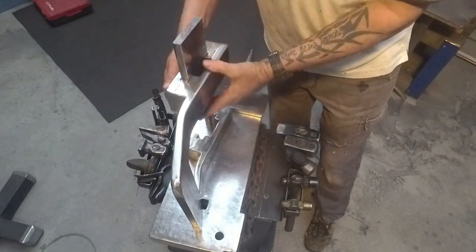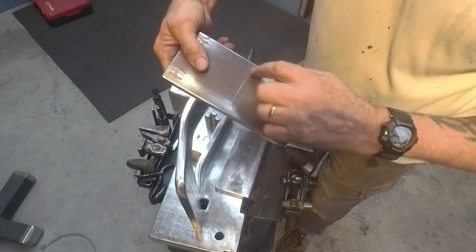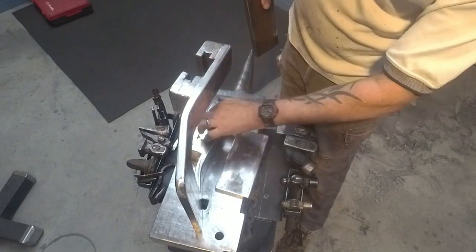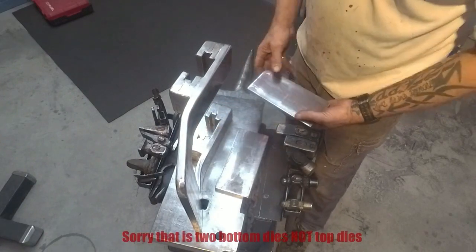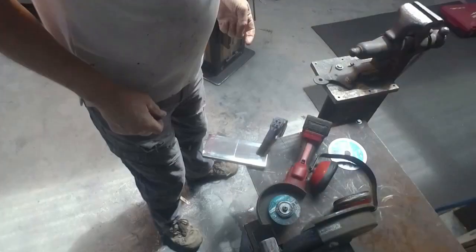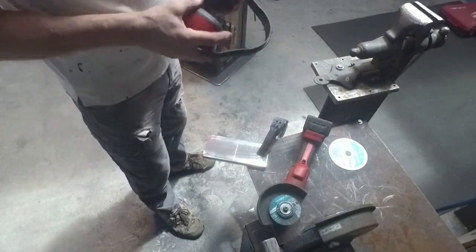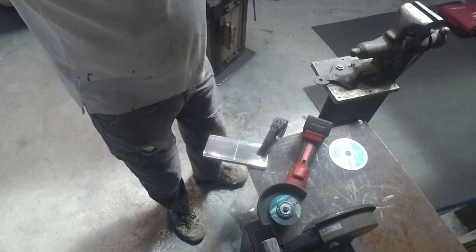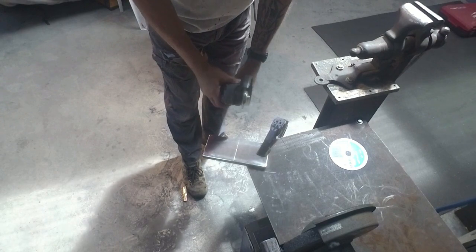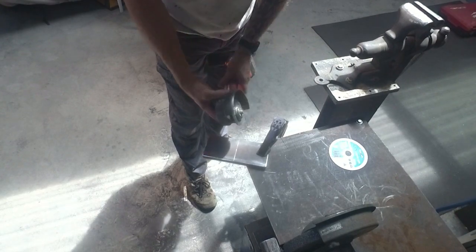She just dropped in — so that's my top die. I've just marked up this here, so now I'm going to cut that in half, which will allow me to slip this into the bottom section which will make one, two top dies. I've got four of those I can make. Unfortunately I only have the angle grinder to cut my dies with so you've got to be very careful to make sure you're cutting the line straight. It's easy enough to cut a straight line — difficult to cut a vertical line with these things.